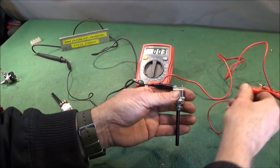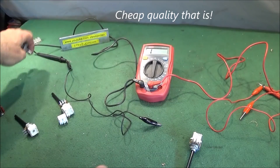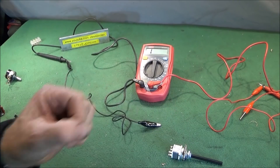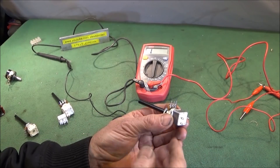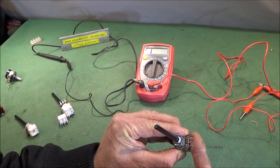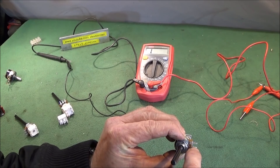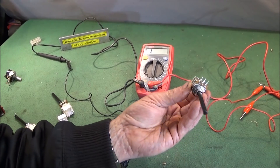That's a great alternative to buying the expensive ones, and when you put one of these on I very much doubt that you'll have any problems with it for a few years or more. All you have to do is fit it back into the electrical box on the mini lathe. The contacts here are exactly the same - P1 is on the lower pin, P2 on the middle one, and P3 on the top one.